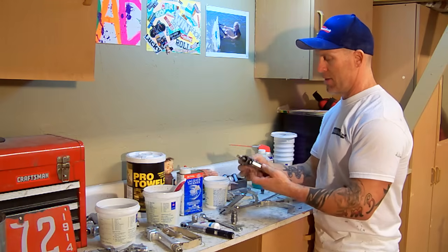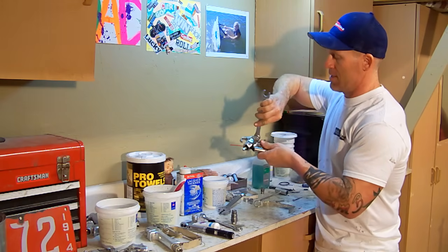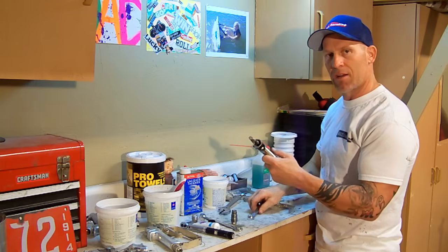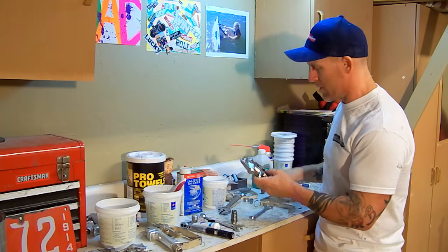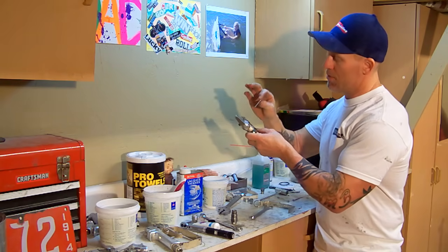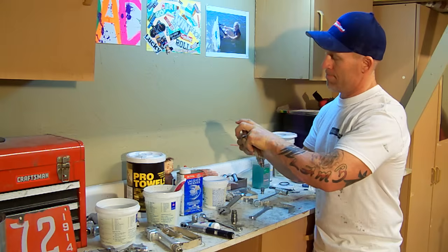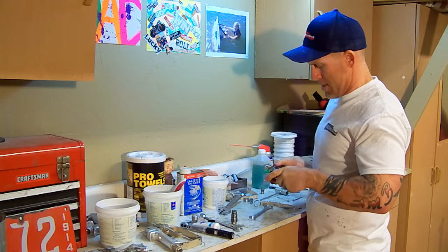And I got the needle there, got this in, so I'm going to tighten this. I'm going to take my 5/8 inch wrench and tighten our spring down. I'm not going to tighten it all the way because I'm going to be putting this other part of the gun back together first. I'm going to take our little pin, drop this pin down through here, this tiny bolt, and make sure it goes all the way through. You may have to push on the needle a little bit to get it to line up.